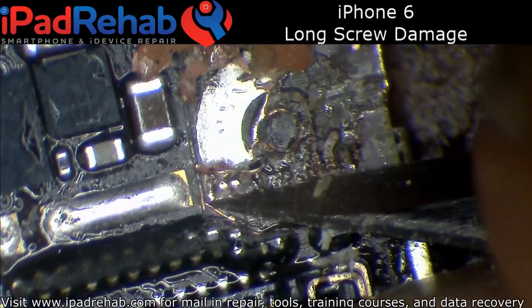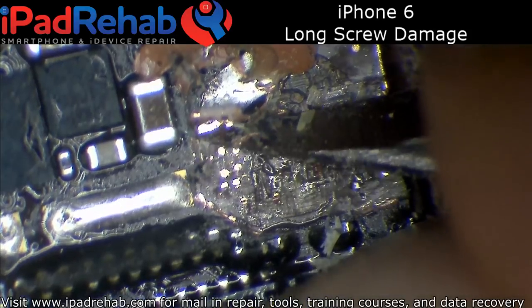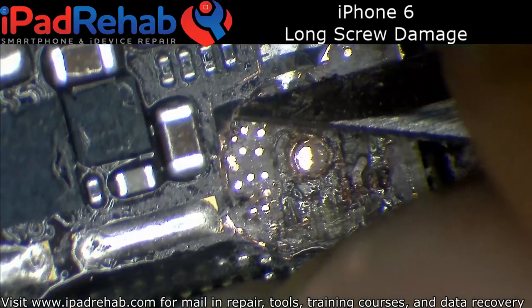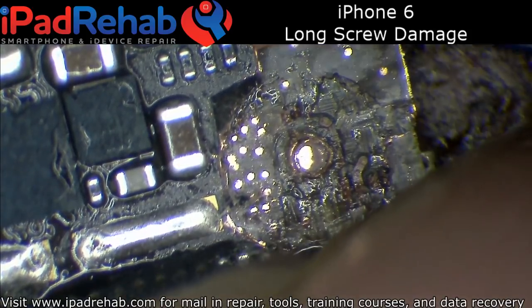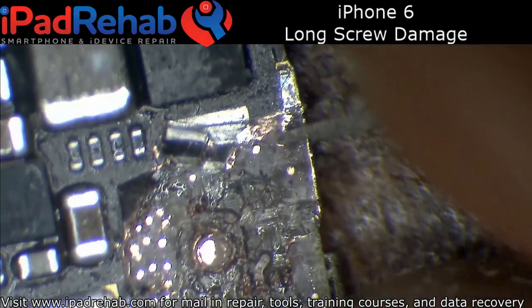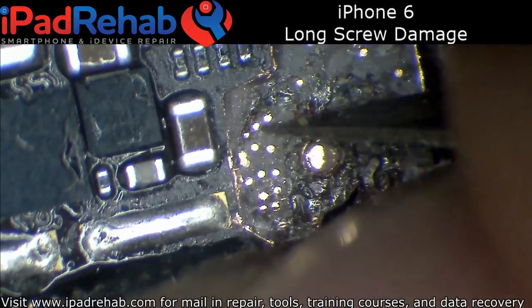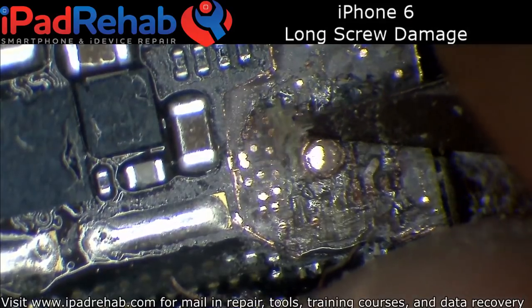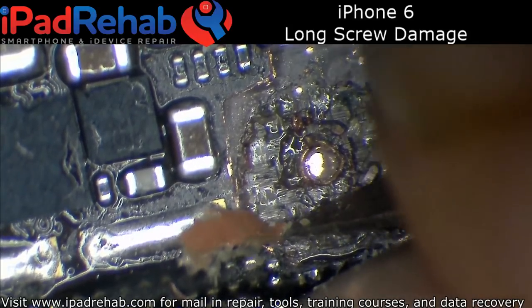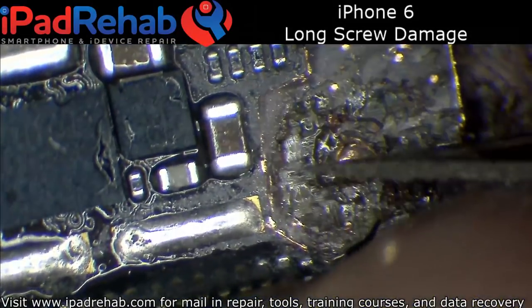We are really spongy in this area. This is just another ground plane underneath the top ground plane — these are all thermal vias to help dissipate heat, so I'm not really worried about those. I just want to get this entire top layer off so I can really see what I'm working with in the second layer. This area is spongy, which is not great but usually not a problem. I like to pull it off so I can have a look underneath — usually there's nothing to fix down there, and that looks like the case now.